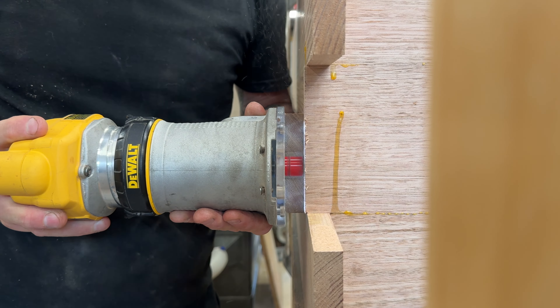So to make this work, I'm going to drill some 20 mil wide holes using a spade bit in the four corners and I'll join those up with a pattern bit. I'll clamp a board down between the two and then run a pattern bit through — same around that side — and that will cut open a hole.